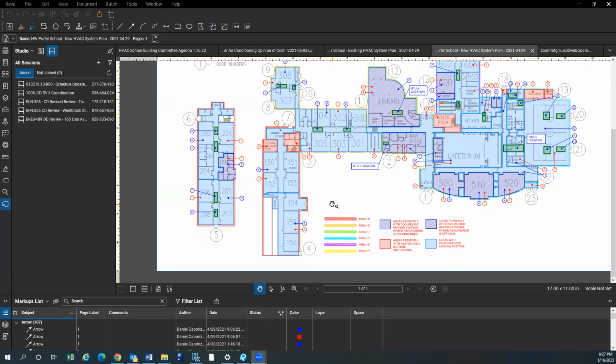We think the most appropriate way to do it is, because the electric room is on the back side of the building in a most difficult location to get to, probably coming up the driveway of Town Hall with a primary electric service. I believe we have a pad mount transformer and a weatherproof switchboard. The switchboard, we believe, would be outside. Unless you're going to give up a classroom over there, we don't think you've got space for that, so I think it's got to be a weatherproof exterior switchboard in order to make all of that happen.